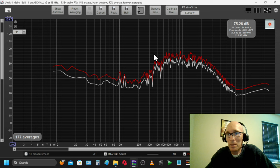There's less interaction with the reflections. You're not necessarily measuring the tweeter. It's all mid-range stuff. Another thing is it's just easy for the speaker to do, to measure this volume of sound. This is the volume of sound that you want to have correct. So I think this is why limited pink noise, or pink noise in general, is the best way to do it. I've seen some full range pink noise before, and I couldn't get it to work correctly because the volume just wasn't correct. So limited is definitely the way to go.